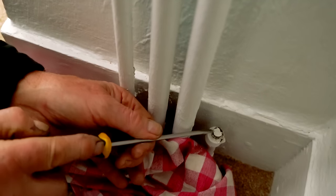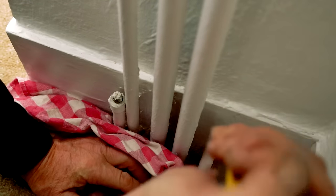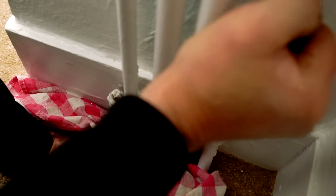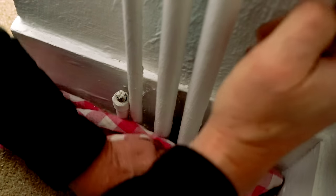Don't undo this too much, by the way. If you've got water coming out like that, that's fine. If you have a little hiss of air coming out first, and then the water - because air is lighter than water - once you see water come out, you'll know there's no air trapped in those.